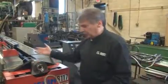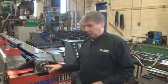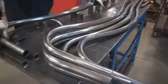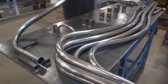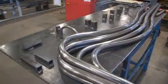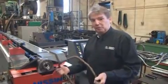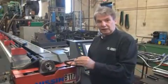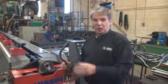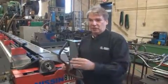The other unique aspect of this machine is that the tube is laid in and rammed through the ceramic ring, and the computer controls the radius as it's coming out. There's very little part marking on the tube because the only part really touching the tube is the ceramic ring, so you get a truly mark-free part. There's no oil inside the tube while it's being bent, which saves a lot on cleaning — often we spend as much time cleaning a part as bending it with conventional bending.